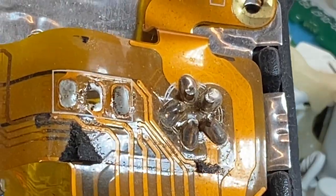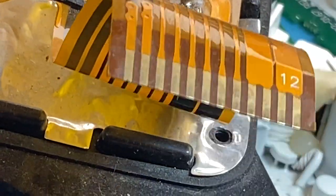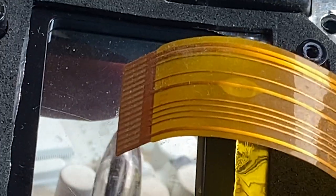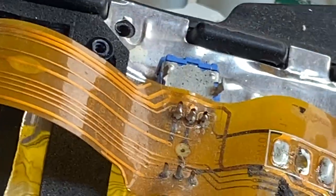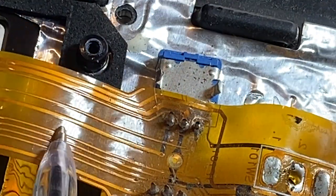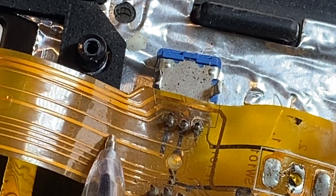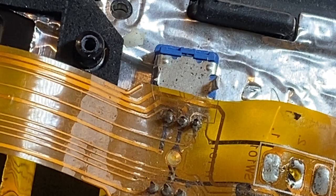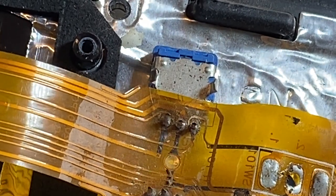And if it's turning on and off, what you can do, and this is really, really difficult, right? So you've got a break in continuity from here, and a break here, and somewhere the break's in the middle, and you can't see it. You don't know where it is. It's very hard to spot, because the Mylar keeps everything lined up, and it's got a coating over it. You can't see the break. You'll know it's there because you'll wiggle it and it'll, you know, be on and off, on and off.